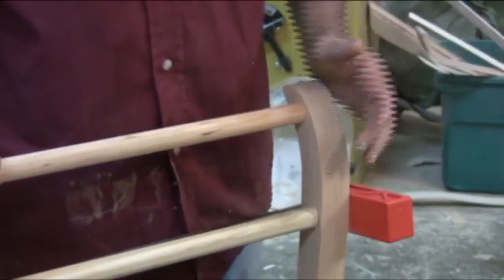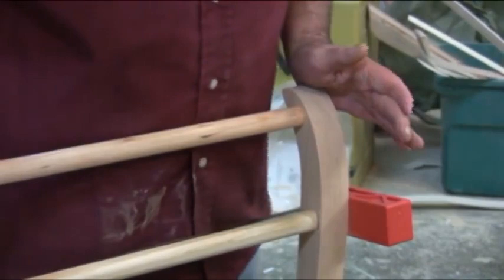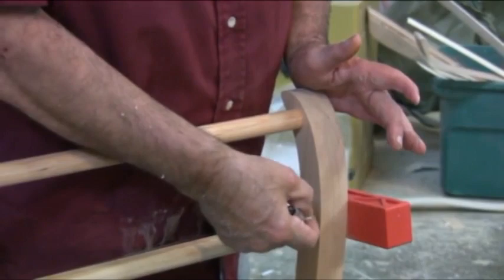And we don't want that. So here's what I've done. I took a quarter inch radius round over, simply because I didn't have a 3/16. And all I did was lower it to round everything over. Now I marked this. I'm gonna set my bit.